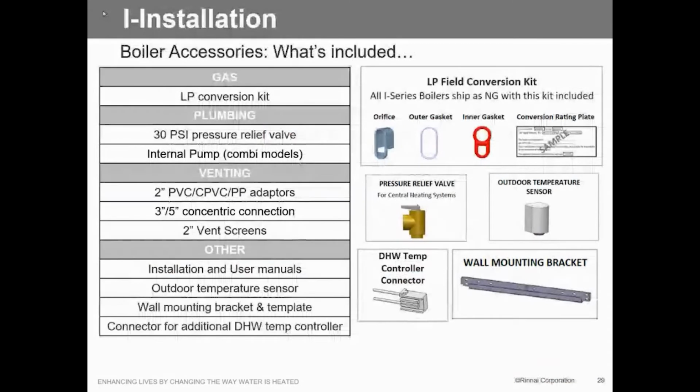Okay, installation. Again, we're coming with the greatest thing I think they ever came up with, and that's the mounting bracket. So you can hang it on the wall and lift the unit up, put it on there. That, to me, is fantastic. The way that we used to do it is, you know, try a screw and then try to find a stud. And not now. And actually, the holes in this thing, even though this is made in Japan, are 16-inch on-center mounting bolts. So they were smart about that. Some of the mini split people weren't.